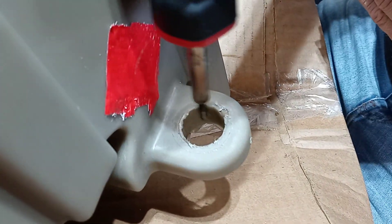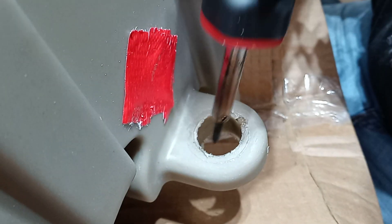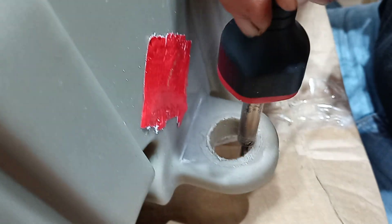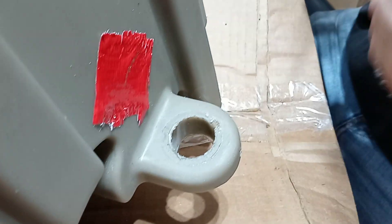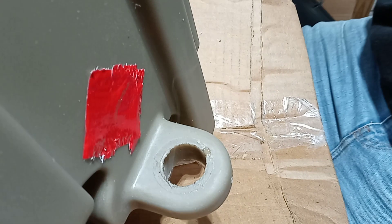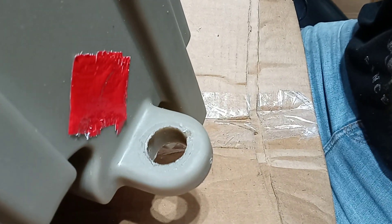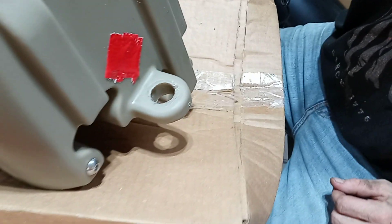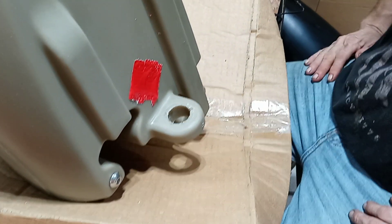You'll see it go around the edges; it's a little bit rough there. This is sometimes how it comes out of the mold. Smoothing that out also heats that area up and will reveal any other small holes that need to be fixed. That was pretty much it for this particular part — about a minute. That's how you do heat welding of a plastic part.